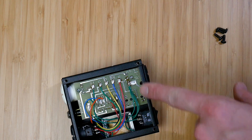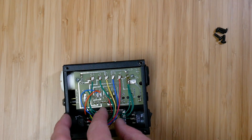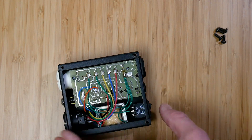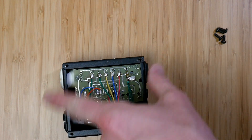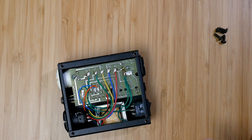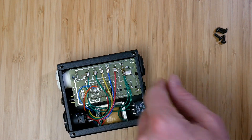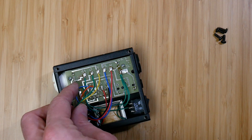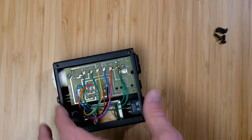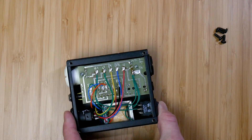You can see the input coming in on the pins and corresponding traces on the right side, and we see the ground wires going out to the lift switches and then onto the PCB switch and direct outputs. We then have our signal taken to the transformer input as well as to the switch for the direct output when selected. After that you can see the various outputs from the transformer going to the isolated XLR output as well as to the switch to be sent to the direct XLR output when the split button is engaged.